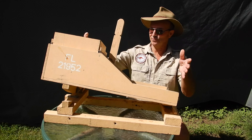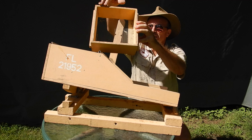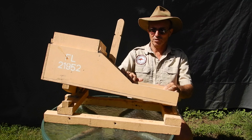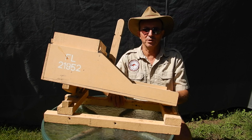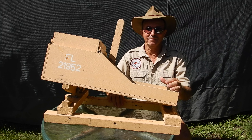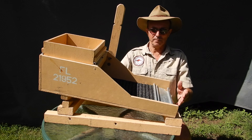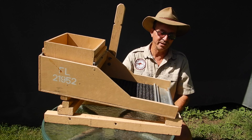Let's run through the dimensions again: two feet long, nine inches wide, the hopper's about eight and a half inches wide and almost square, about six inches in height. You can make your dimensions proportional. I've got a link in the description to the NQ Explorers vlog where there's a link to the actual plans I used — I adapted them slightly. If you've got a piece of plywood sitting around in the shed you'll be able to knock this one up in a couple of hours and you're into the hobby of prospecting.